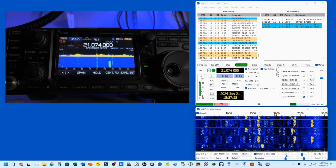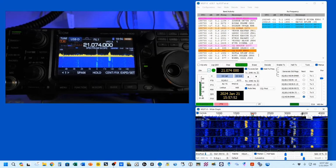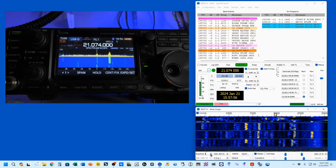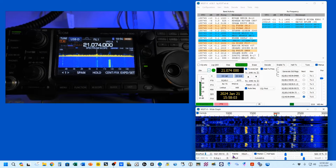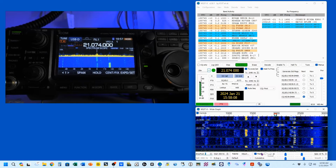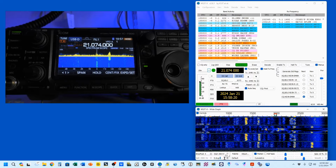Decrease the sensitivity of your waterfall. You can adjust the bins per pixel, and you can see the frequency up here is changing. You want to adjust it to where your full bandwidth, and remember we're at 300 to 2700, which we set in the menus. So we're starting at 300 and we're going up. Here's 2700, so this bins per pixel 5. This N average will select how fast your scroll is going. You can see it's going very slow here.